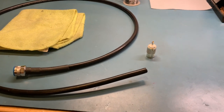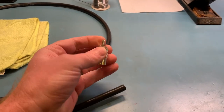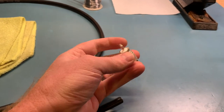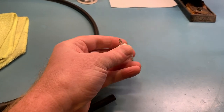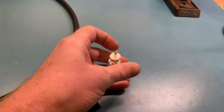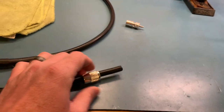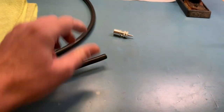One of the first things I want to do — and this is really important — is make sure you don't assemble the cable and forget to put your sleeve on the cable first. Don't solder the connector together on the cable when you can't get the sleeve on. So first thing we're going to do is put the sleeve on the cable and just drop it on there. So now I don't have to worry about that.